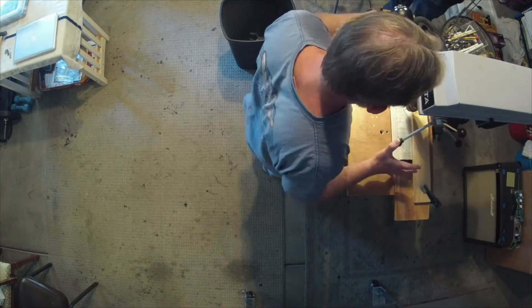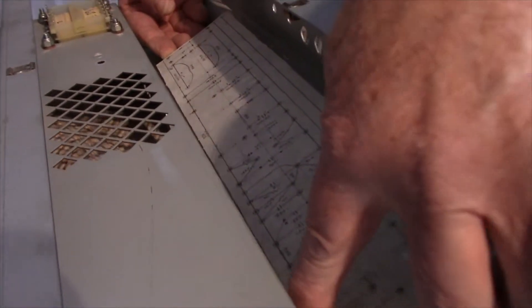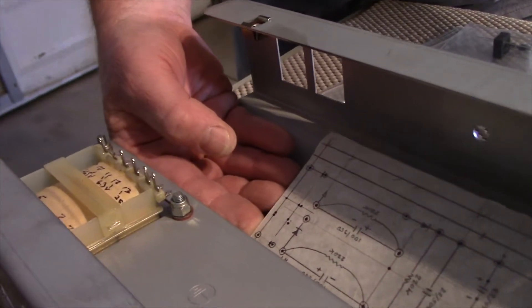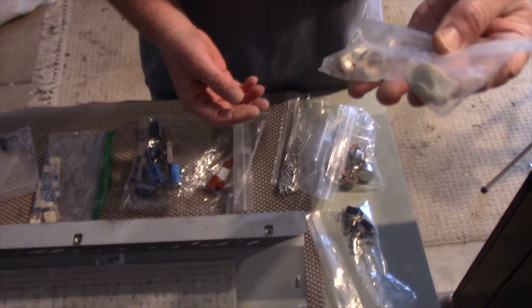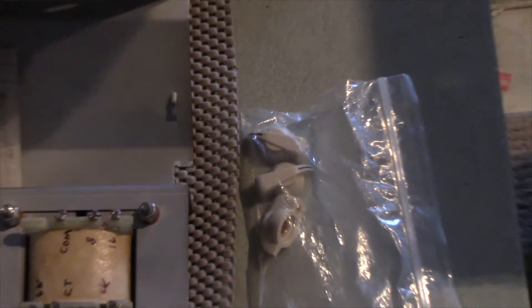Craig confirms we're good to go for reusing the chassis. Everything lays out just perfect — we've got short wire runs going to each tube socket, and we don't have to be concerned about heat on any capacitors because it's all going to rise through here. For finishing touches, we've got some cream-colored knobs here, which are going to look nice with that cabinet.